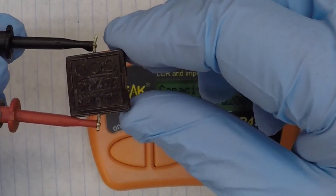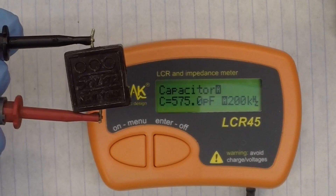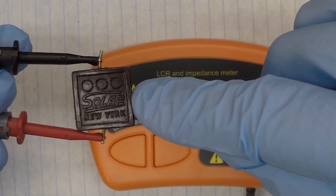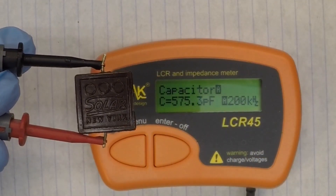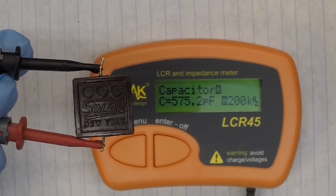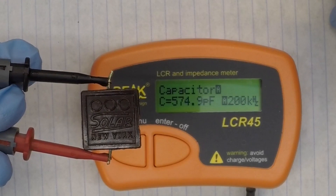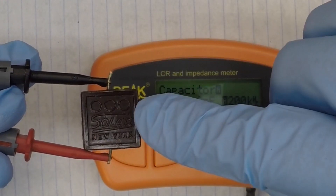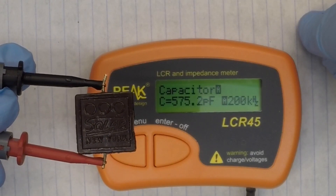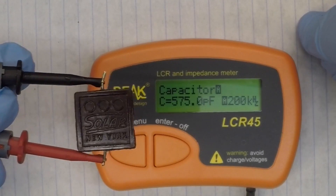The seal, for whatever reason, has been compromised over time. Next time I think I have a mica issue, I may try to grab the old needle-nose pliers and try that trick — compress the body of the capacitor just a bit and see what happens to the capacitance value. Thanks again for watching, folks.